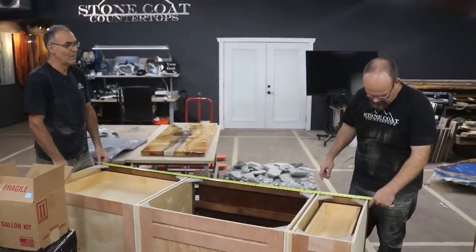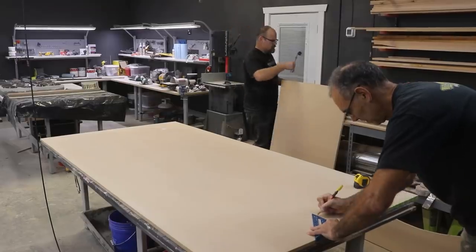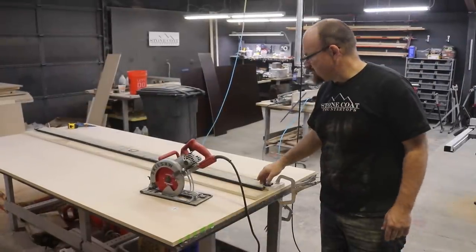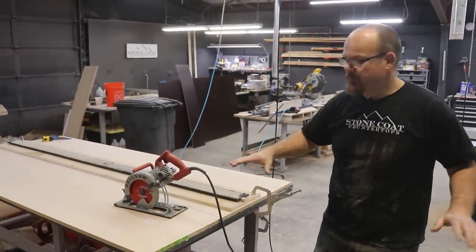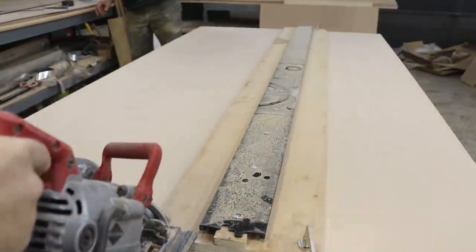We're 75 and an eighth on the face frame — I'll go 75 and three-eighths. First thing we're going to do is rip it in half. The reason we're using our straight edge here is because this is going to be like a factory cut — this is what's butting the back wall. The front will get a rock face, but we want to keep this nice and true, so a saw guide comes in handy.